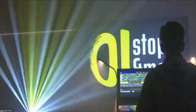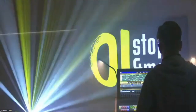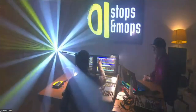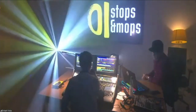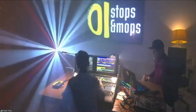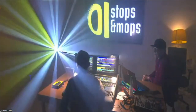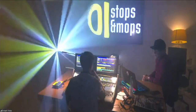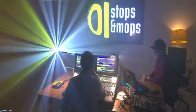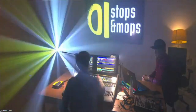Okay, we have another question. We've had this one before: how many DMX channels, and is there more than one DMX mode? I remember it's about half a universe of DMX channels. Yeah, it's close to half a universe. The fixture library is fixed for now. So it's half a universe if you patch all layers, including the master layer that goes on top, the global influencer. You don't need to patch all of them, but if you do, two of them fit on one universe.